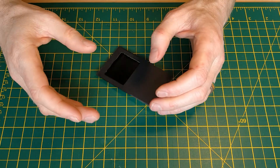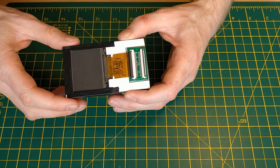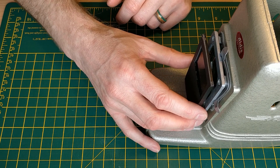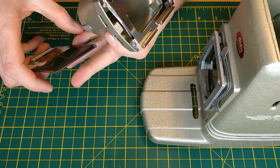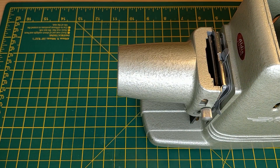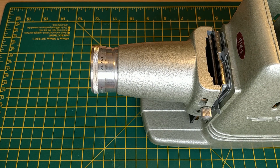Once I decided what screen to use, I made this little mount out of foam board. You can see the screen in there, and the connector goes through an extension socket with two 50-pin connectors. The light comes out from where the LED is, goes through the polariser, and then through the screen and projects onto the wall. This assembly actually slides into the original slide holder, which slides onto the front of the projector. Then finally, we can screw the lens back in and hopefully it all works. Now you've seen how that's put together, let's plug it all in, set it up, and let's play some games.